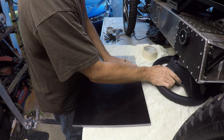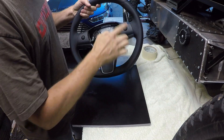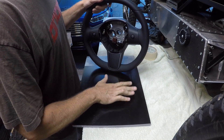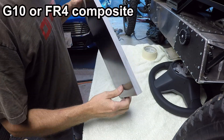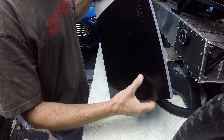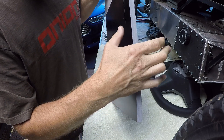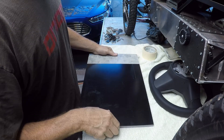In this part of the steering wheel project, I want to show you the material I'm going to be using. You can remake this hoop in a number of different ways. For the purposes of today's video, I'm going to be making the hoop out of an extremely strong composite called G10. This is a composite material — it's more resilient than fiberglass, meaning it won't crack as easily, but it's not quite as strong as carbon fiber. This happens to be a half-inch thick. I have three panels of this half-inch thick G10, and I'm going to stack it three panels thick and cut the steering wheel shape out of it.